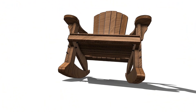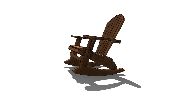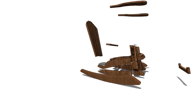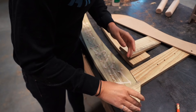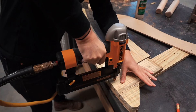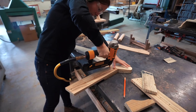I'm using one of my favorite methods to make a half-lap, which is putting together two layers of one-by material instead of cutting a recess in two-by material. Everything is intertwined to create strength, but it's very simple and quick. I always first lay out my parts to make sure things will work and line up, but once I see it's good to go, I start gluing and brad nailing things down. It's important here to make sure the bottom rocker is really flat and smooth so that you end up with a clean rock on the finished product.